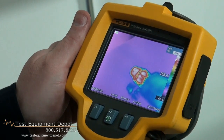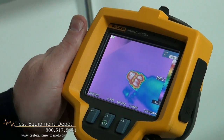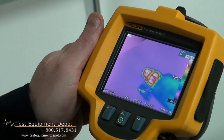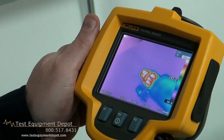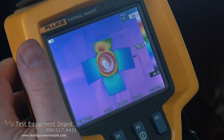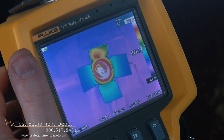So this will help you find electrical problems — shorts, grounds. Anything that has an excessive heat signature is a problem and has to be investigated. Right now that light bulb is at approximately 200 degrees. You do not want to be grabbing that.